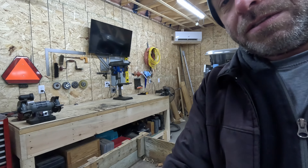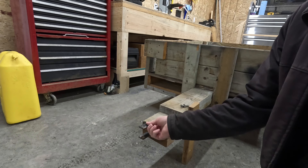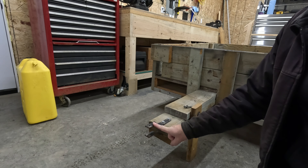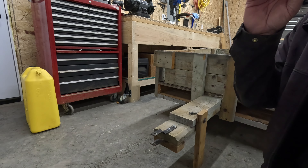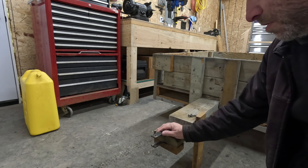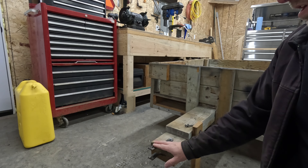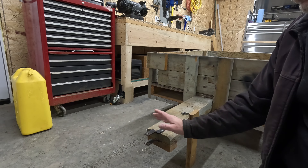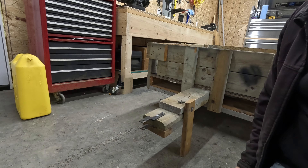What's going on is that the hitch itself and this part here is made out of metal that I found out in the backyard. I think it was part of an exercise bike, because there were pedals attached to it, but it was only parts of the device. You can tell by the powder coating on it. This metal here is not that strong, so if there's any kind of load in the trailer, this will start bending up. I always got to clamp it down and bend it back down again. I can bend that with my fingers, no problem.